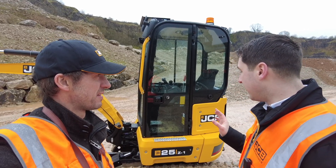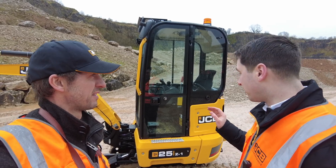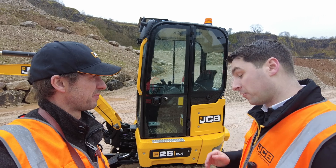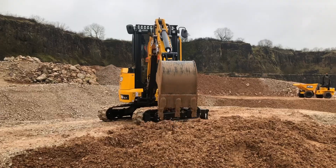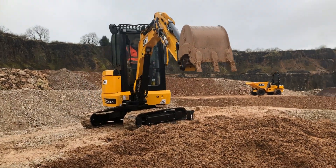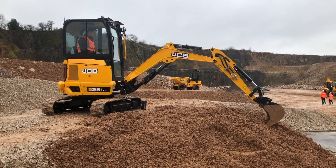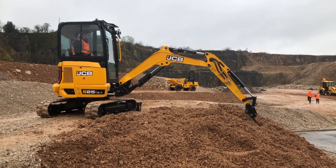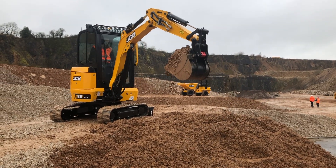What's really important about the machine is the brand new cab — fantastic space within the cab. There are no more auxiliary pedals on the floor. They've been moved to proportional roller controls on the joysticks as a standard feature, which makes the leg space even better. Within the cab there's a brand new display with a rotary control system, similar to what you see in much of our larger excavators, now in a smaller machine.